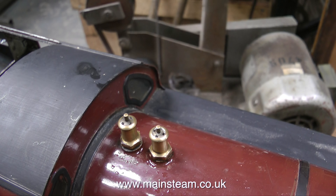In order to perform a hydraulic test on the boiler of this locomotive, the safety valves need to be removed, I need to cap off the pressure gauge, and hopefully the regulator won't leak. But the problem is the threads on these safety valves are threads we've never seen before — they're not metric and they're not imperial, and none of the blanking plugs at the Steam Workshop would fit the threads in the boiler.